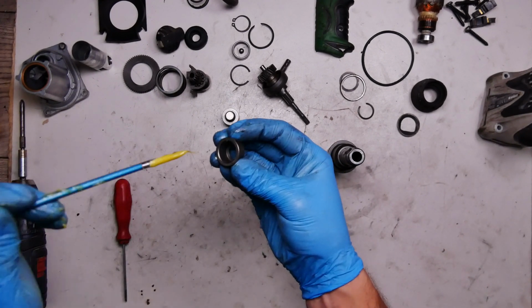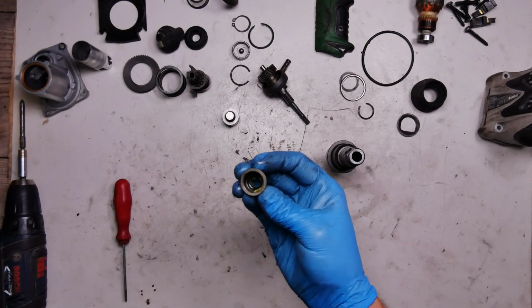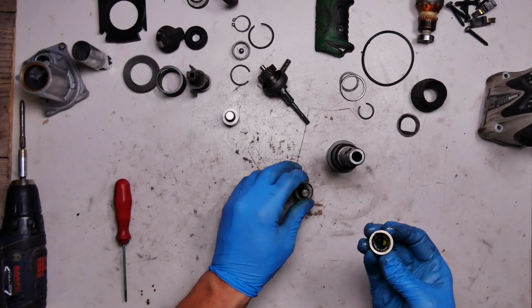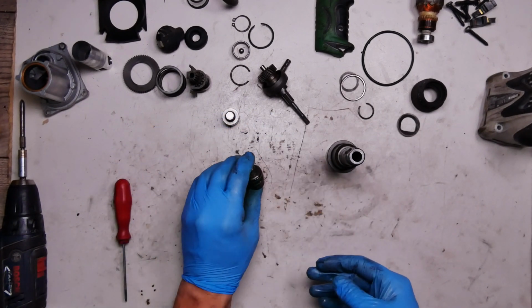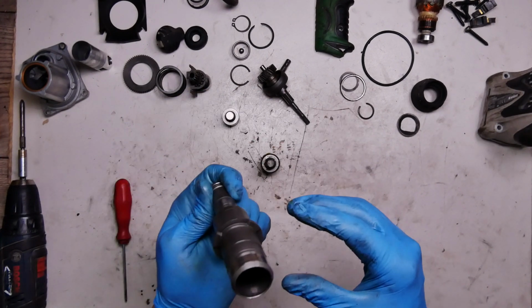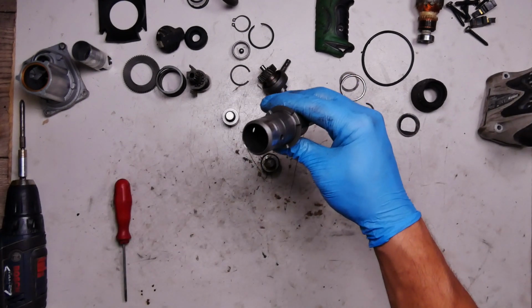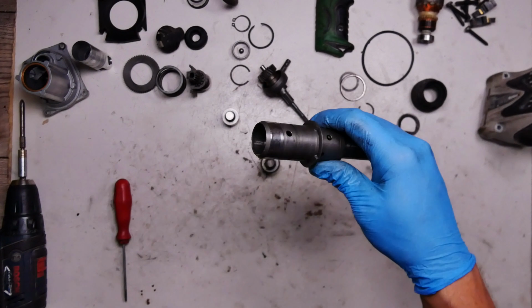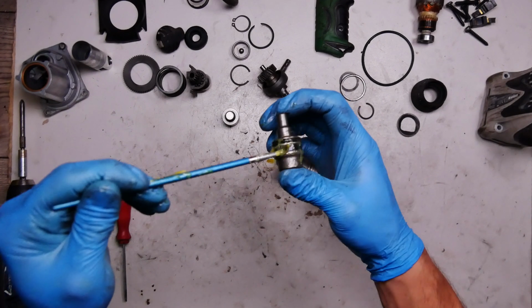Okay, now we have this housing. I'm greasing inside of it and putting the O-ring on it and greasing the O-ring. Now I can close it, and we have the hammering part closed. Now we need to insert everything in a cylinder. I will grease it from the inside. It will be easier to close it. So we have greased this part, but I will grease it again.